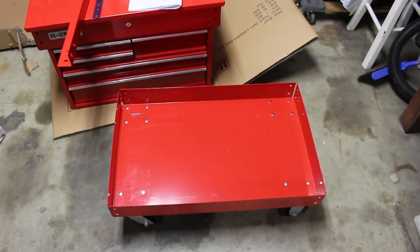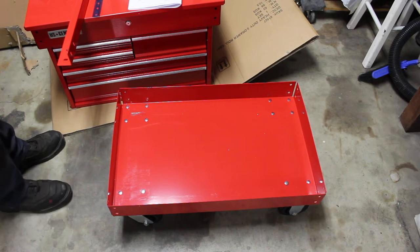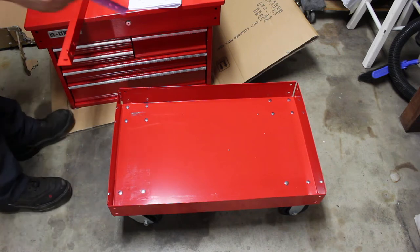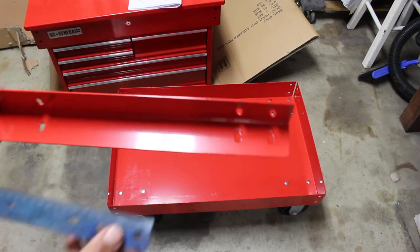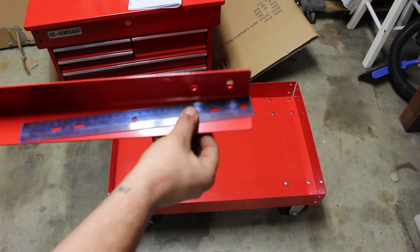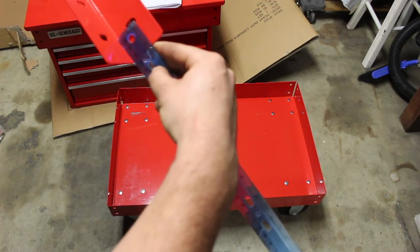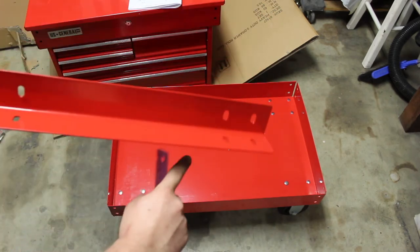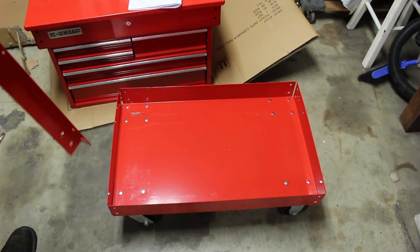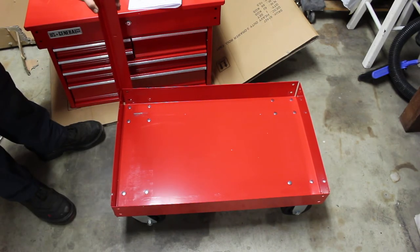So what we're going to be doing is attaching the four posts. In the instructions it says to make sure the bolt holes on the upper end of the post measure 1-3/8 inches from the top, and the lower holes measure around 1 inch from the bottom. So right here, we have 1 inch from the bottom, and the top one we're measuring 1-3/8. So that means this is going to be the bottom post and that's going to be the top. We're just going to place that down right now — it's going to go on the outside — and then we're going to bolt that in.